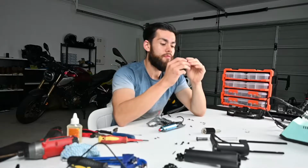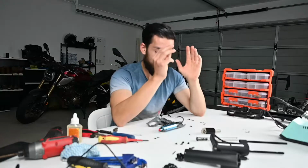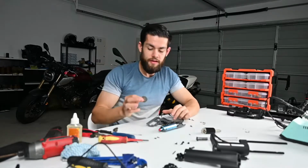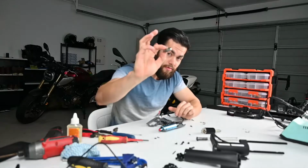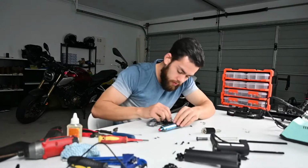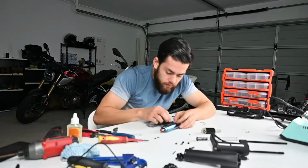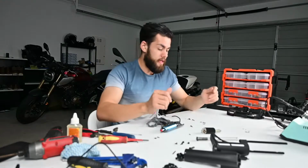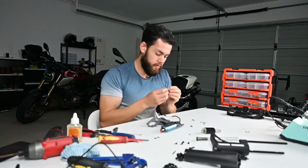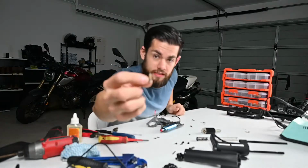And then for this one, I would recommend, it really doesn't need much. I usually like to just put a 0.1 millimeter shim in my gear one, a 0.5 millimeter shim in this one, which I'm gonna call gear two. So let's put that into place. And then we have to put in our anti-reverse latch, which is this piece with a spring.